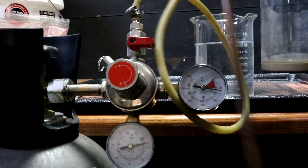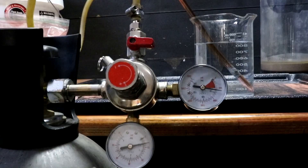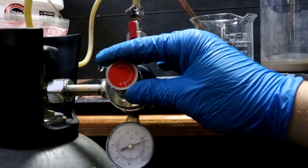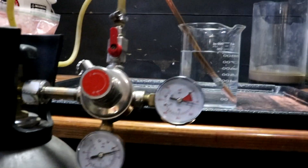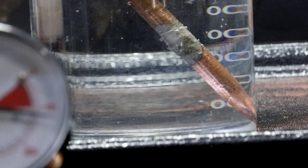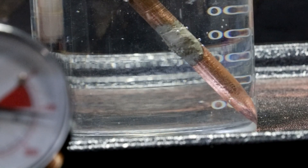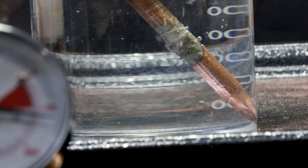I've got the pipe hooked up to my CO2 cylinder to measure pressure. I'm only taking it up to a couple of atmospheres — more or less just a leak test. At two pounds per square inch it's leaking like a sieve without even any real pressure behind it. The mercury amalgam is porous, so it cannot be used to patch a hole. Increasing to 10 pounds per square inch, then up to one full atmosphere — it just sits there and leaks.